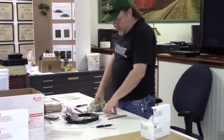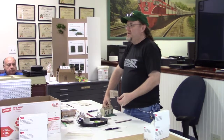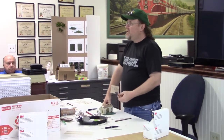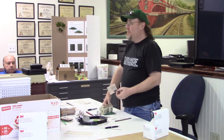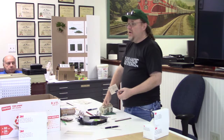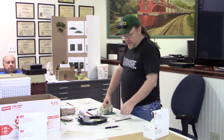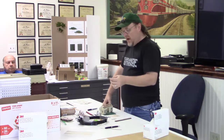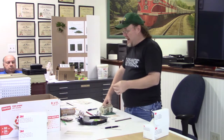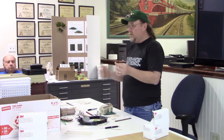Also, all of these little pieces left over on these sheets, think of it as an old plastic kit where you had all the sprues left over. On these carrier sheets, save these things, because the pop-outs on the windows are a perfect 90-degree corner. So if you're not putting an interior in them, use it as corner bracing. It'll help keep your corners square. Underneath the desk, for example, I didn't give you all the parts and pieces for the interior, but when I built the prototype on mine, I literally just took a couple pieces of strip wood and stacked them up underneath, and away we went.